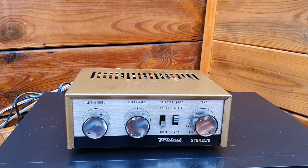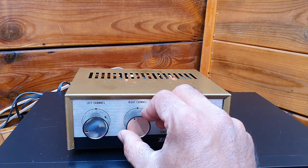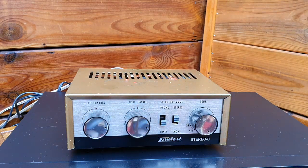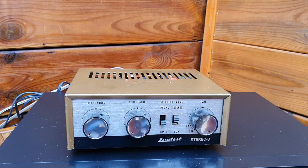The sound quality is not that excellent, which tubes are famous for. Perhaps the electrolytic capacitors inside are already dried out. That's why the filtration is not adequate and sound is not very crisp as it's supposed to be. It has less noise and frequencies are clear, but sound is not as rich as tube amplifiers are famous for. Even the tubes are still very good, but the warmth and fullness in the sound is missing.